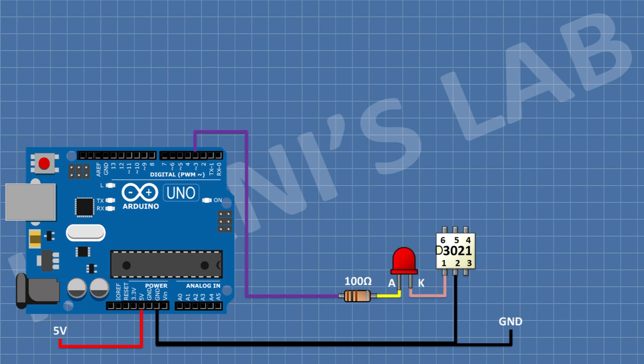After that, connect an LED and connect its cathode to pin number one of the IC and its anode to the remaining pin of the 100 ohm resistor. After that, connect BTA16 and connect its pin number one to the phase of the AC signal and its pin number three to pin number four of the IC. After that, connect a 220 ohm resistor and connect its one pin to pin number one of BTA16 and its other pin to pin number six of the IC.